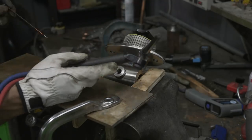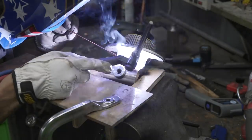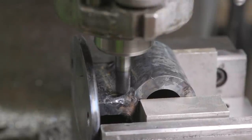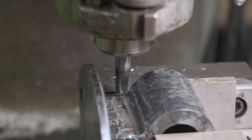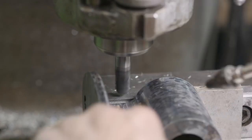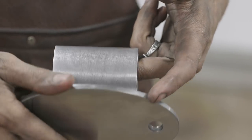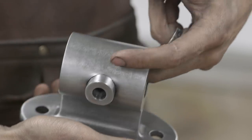I was TIG welding this over at the vise just so I had a good position. I really wasn't concerned with the look of the bead — I just wanted to get the weld built up so that we had a good surface to mill down. Similar to what we were doing before, we're just milling down the weld with that half inch rounded ball nose cutter. It's not exactly the radius we want, but that's okay — I clean it up with a hand file just to dial in that last amount. After cleaning it up on the belt grinder with a Scotch-Brite belt, this is the final look. It turned out quite nice and will be more than adequate for something that gets painted.